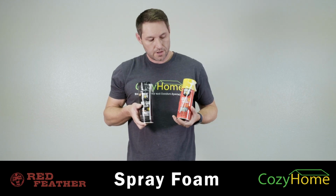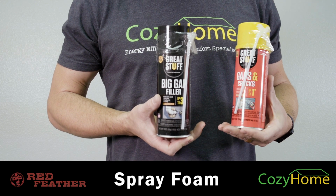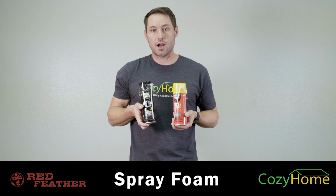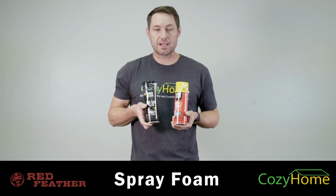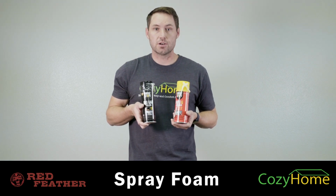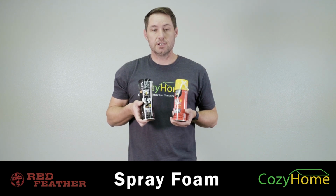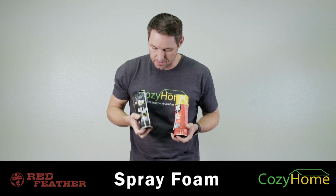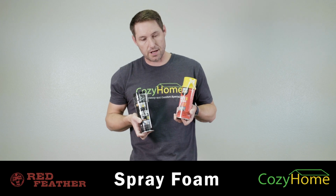This is called one part foam or spray foam, and these are used to help cut down on air leaks by sealing up gaps where you have maybe a hole in your drywall, or where a pipe comes through the drywall, or maybe there's a gap underneath your wall around light fixtures, anywhere where there's a gap that lets outside air in and you need to seal that up permanently. This stuff works great. I have two different kinds here. This is the big gap filler, so it works on larger gaps, and this is for like a smaller gap filler.